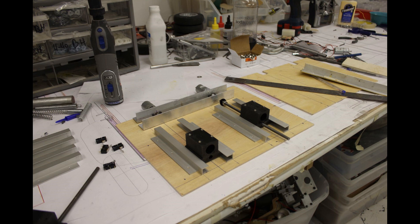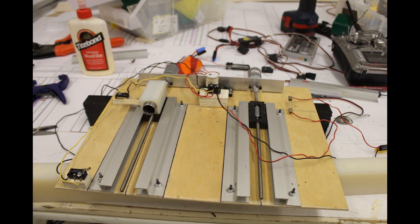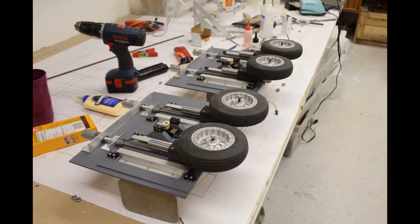As I started to assemble all these, alignment was one of the most important things. I also needed to create a coupling between the electric motor and the jack screw, and I had to use thrust bearings because these did put a lot of thrust as they went up and down. Here you can see a mock-up of the nylon 6 pressing into the 5/8-inch tubing, which was basically the landing gear strut. Here's a picture of me test-fitting the wheels on it. At this point I thought I had a really good design, but the servo motor that turned everything really became problematic.